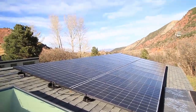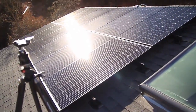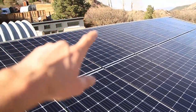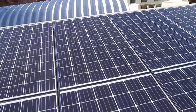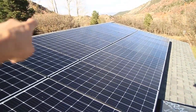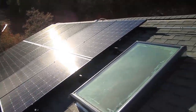I can't just wire all 30 panels. I have 18 panels over here and 12 panels over here for a total of 30. I can't just wire all these in series. What I have to do is take 15 panels from this side, take the 12 over here, and connect these three in series. So I have two different strings of panels — one string of 15 and then three plus these 12 over there linked in series.